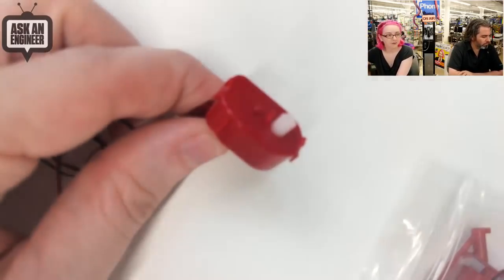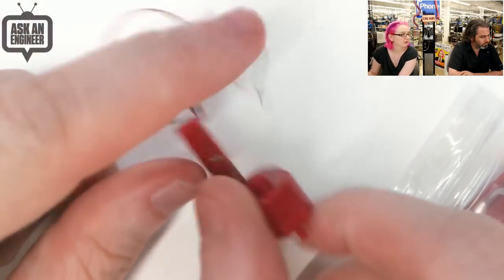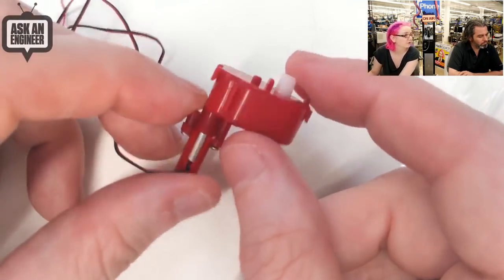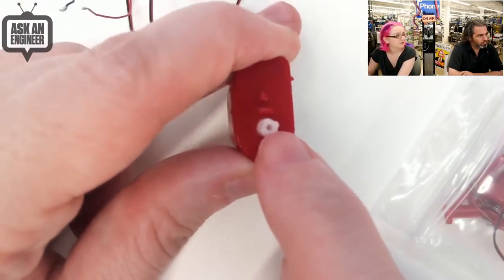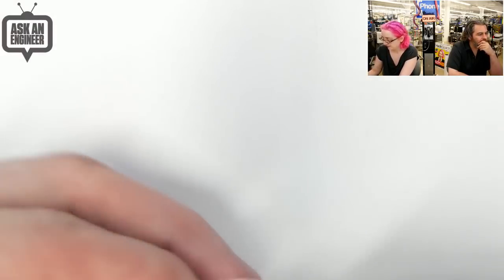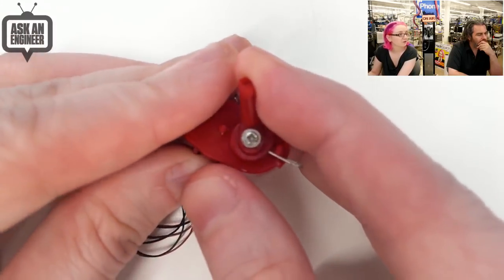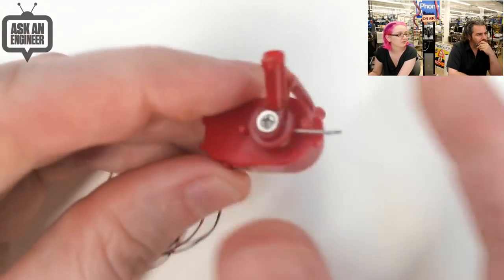So this is it with the plastic piece off. Inside here is the pager motor — it's a very small motor with nice long wires. In here is a gearbox and then a gear. It's actually quite strong; it's geared down, probably about 100 times or so. It's got a cloverleaf-shaped axle so you can connect stuff to it. The version as it ships has this plastic piece that moves about 60 degrees in either direction, and there's a springback. So if you let go of the power, it'll eventually go back to center. It's a self-centering motor.